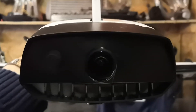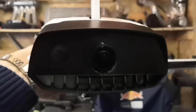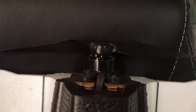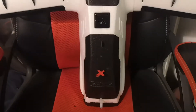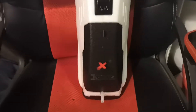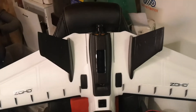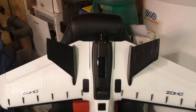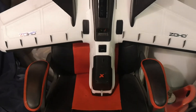The lens is a very small modification to fit into the pre-existing piece. The next change to the OEM Parrot Disco part is the motor. This is the OEM folding prop Disco motor, which will plug directly into the Parrot Chuck flight controller. I had a lot of concerns about this piece - I thought if I can't use the stock motor it's going to be extremely difficult, because this has features like reverse thrust built in. The ESC for that motor is actually contained within the Chuck, so changing the ESC would certainly be a complex scenario. The great news is we just need a short extension on the power cables to this motor and it will reach the Chuck without difficulty.